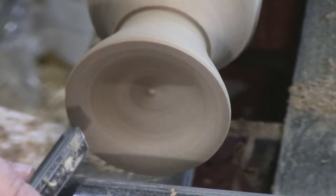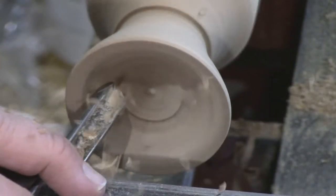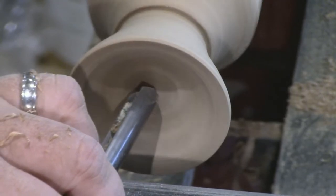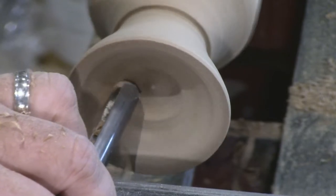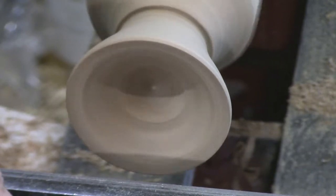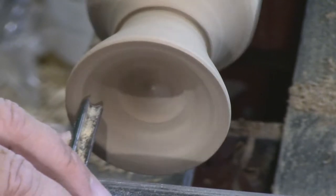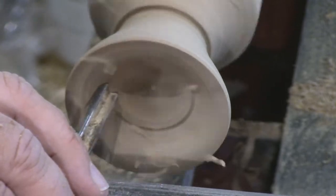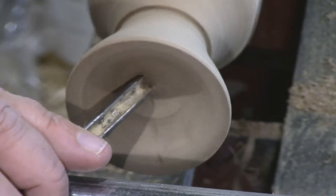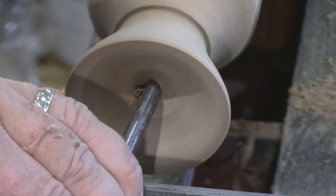Tool table over here. And we can also work from the center. You can kind of drill your way down in there. So that's a traditional, more standard looking bowl gouge. And I also have my little quarter inch bottom feeder style tool that is one of my favorites as well. Now it's harder to work from the inside with this one because of the way the wings are.